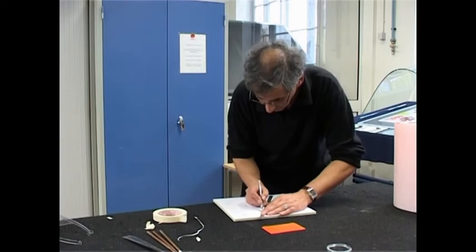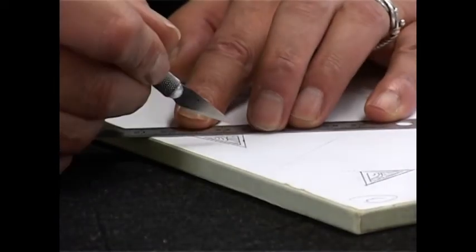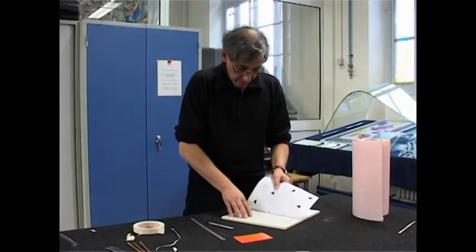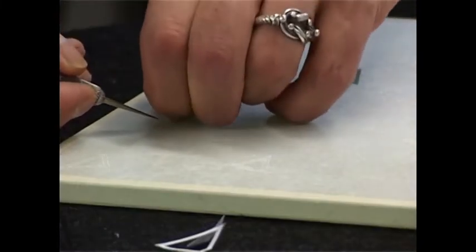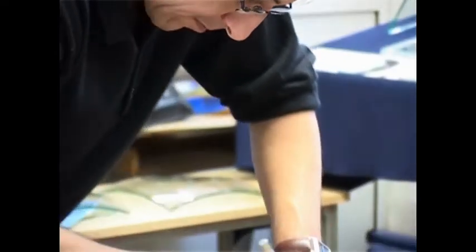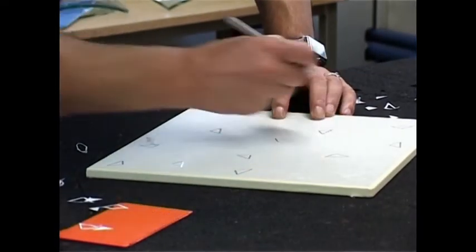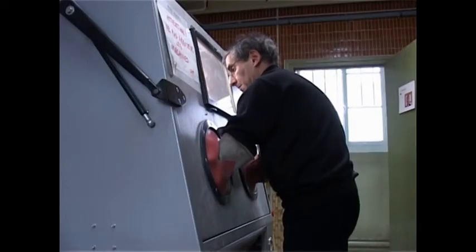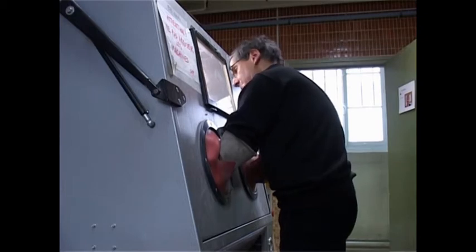The triangles that comprise the pattern are bordered by a 2mm wide furrow. The strips of masking film that surround the triangles are cut and peeled away. The exposed parts are sandblasted to a depth of at least 2mm. The depth varies according to the thickness of the glass used for bouchardage. The key to successful bouchardage lies in the aspects of the engraving depth.